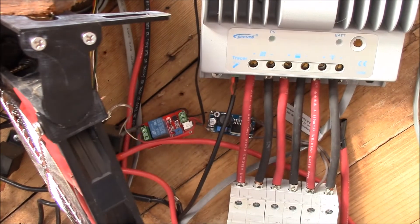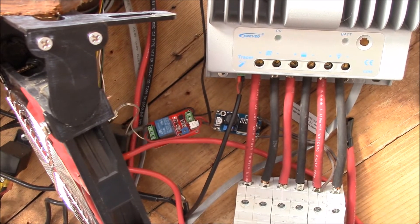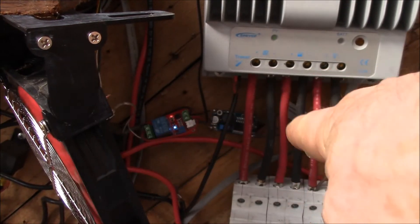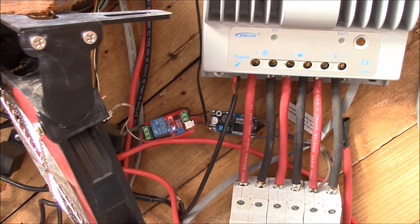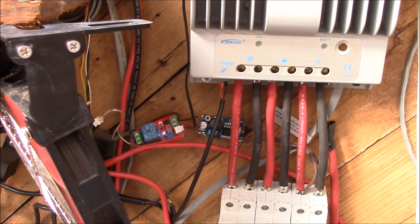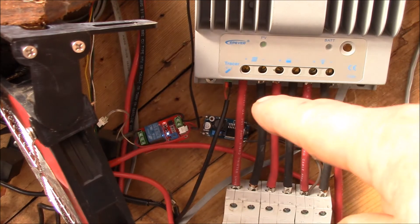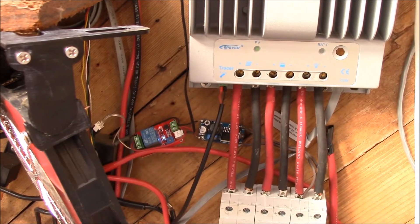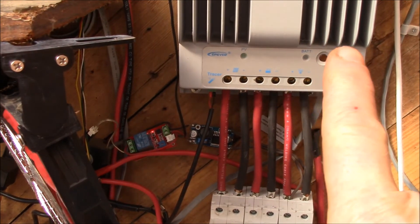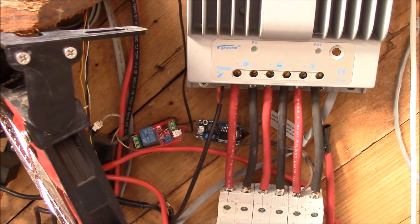One of my tasks right now is I've got a few more loads in the house that need step-down converters because they probably won't handle 16 or 24 volts. My attic fans are running off 12 volt lead acid batteries right now, so I need to put a step-down converter in the control box. I also have one load that needs 15 volts — so from 16V I'd step down, but from 12V I'd need to step up. My backup power supply is 13.8 volts, so I need to convert a boost converter into a boost-buck converter.